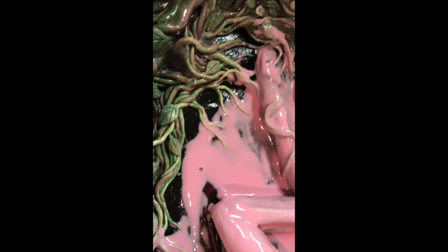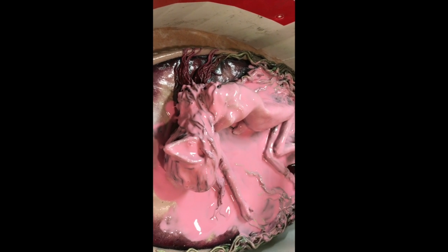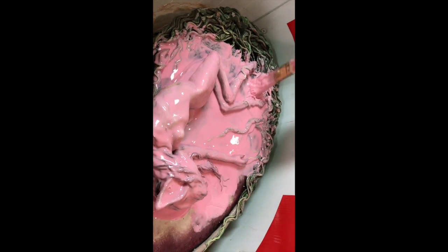We're coming in with some canned air. Look at the top of the head — see those bubbles coming up? That's what we're doing — you're gonna be chasing bubbles. It's nice if you have a vacuum pot — you can vacuum out all the air before you even begin. We don't have that luxury right now, so we're doing everything old school. You swab it in; it's diligent elbow grease at this point.